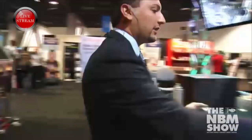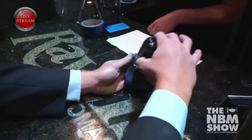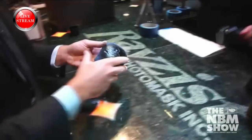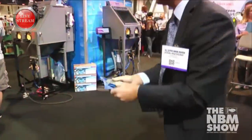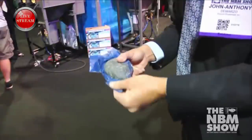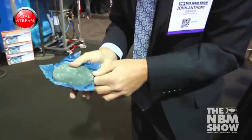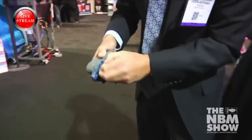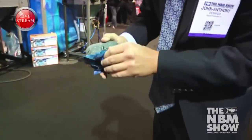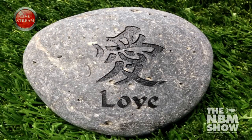The last step here is just hit it with a little air dry. And now it's cleaning — just going to peel that tape up. Notice I'm holding it upside down, which keeps all that abrasive out of that paint, just in case it's still a little bit wet. And you'll see that photo mask begin to come up. Now remember we applied a little bit of extra glue, so it's going to be a little more stubborn than usual, but it should still peel up fairly easily.